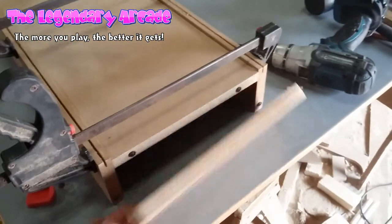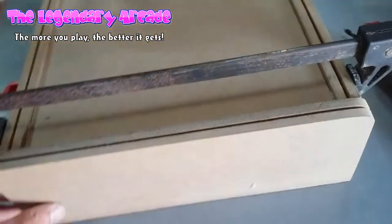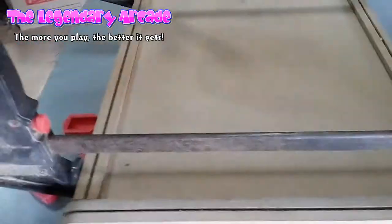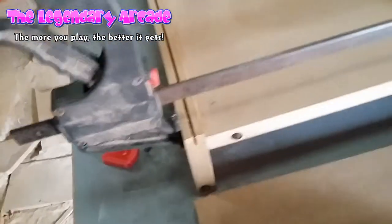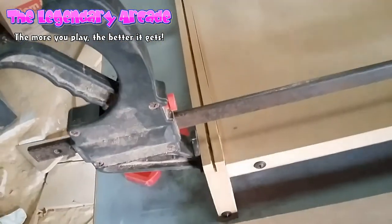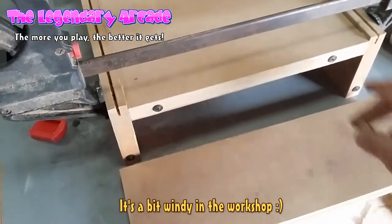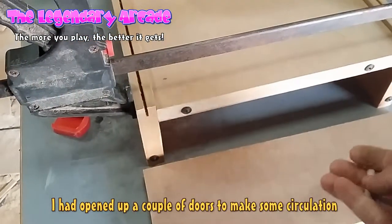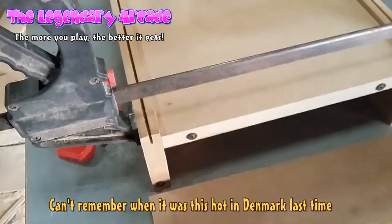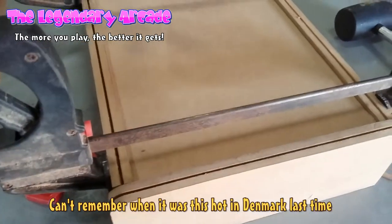Then I'll take the side, flip it up, and make sure that it's aligned. I can't demonstrate this fully while recording, but I'll explain: make sure it's aligned where it needs to sit and give it a quick bash with a hammer. This will mark where the dowels are to be positioned. Then I can drill the holes using those markings, insert the dowels, add glue all the way around, and it fits perfectly in place the first time — giving a very nice connection that will stick together for many years.